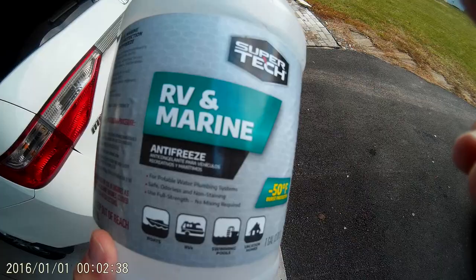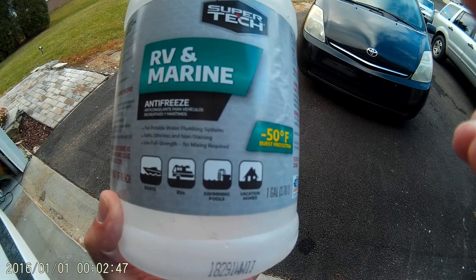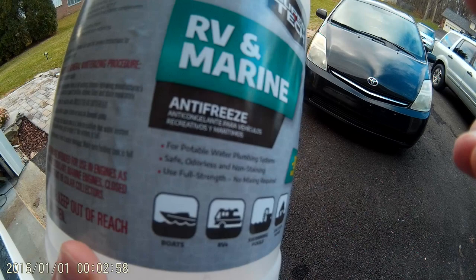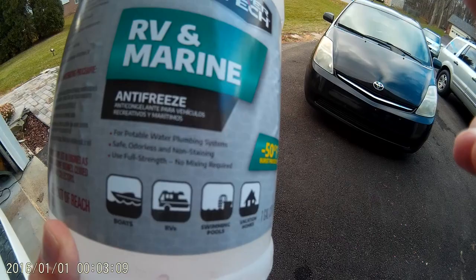Here's a little bit about this product — it's used for home plumbing or for RV and marine. You can pick this up at Walmart. You can even use it on regular water systems. It's safe, odorless, and non-staining. I just pour that in once a year. Usually evaporation takes some of the water out, so I usually just put one gallon in before the winter. That's how I do it — quick tip, thanks for watching.